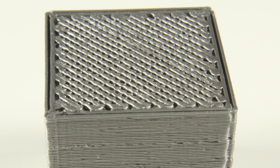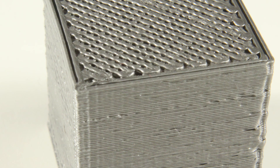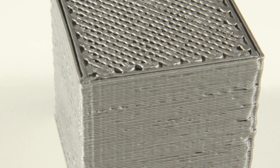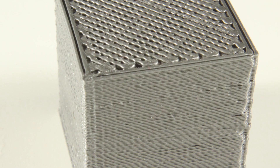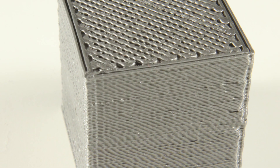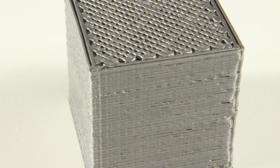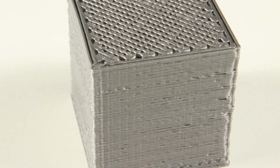You can really see what the 3D printer did — the two outer shells aren't even fused together, they are completely separate, which shouldn't be the case at all. And the solid infill in the middle is more like a perforated mesh. This is actually a best case scenario for a print with too little extrusion. Mostly you will see very messed up sides with sometimes big holes as the filament can't really get there. You will know if it extrudes too little — believe me. And you really need to fix that.